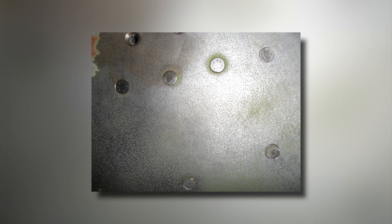These aluminum wing skins are machined to thickness and then shot peened to form contour. This creates a compressive residual stress on the surface that improves the fatigue resistance of the skin panels and protects against both fatigue cracking and stress corrosion.